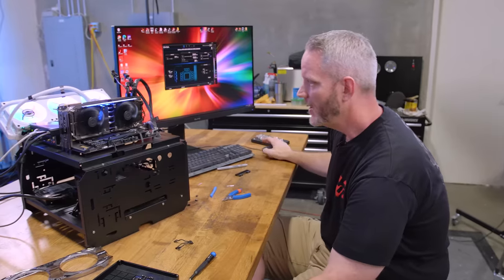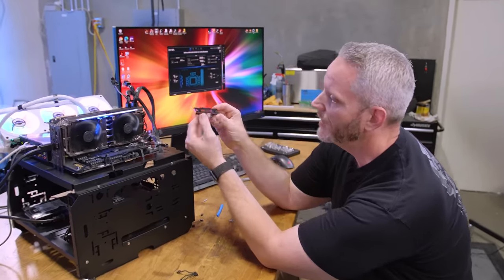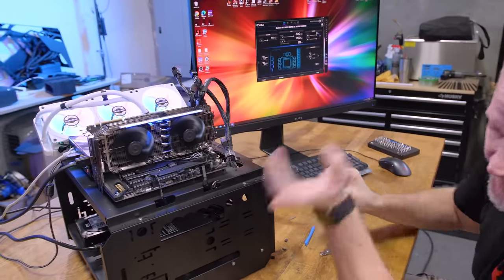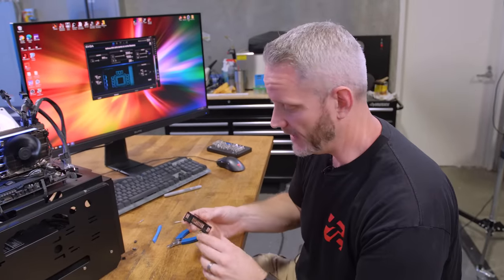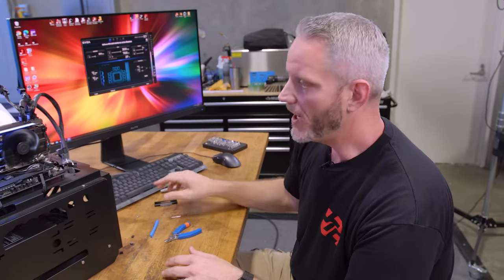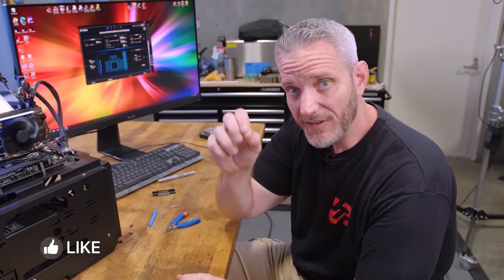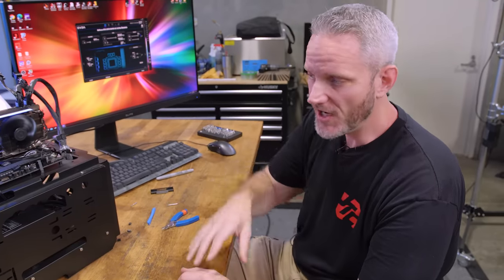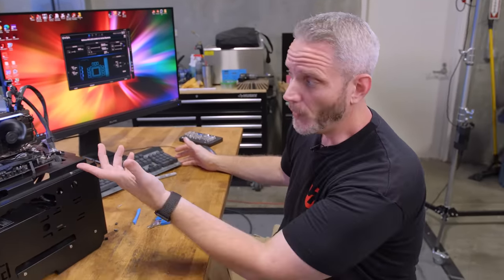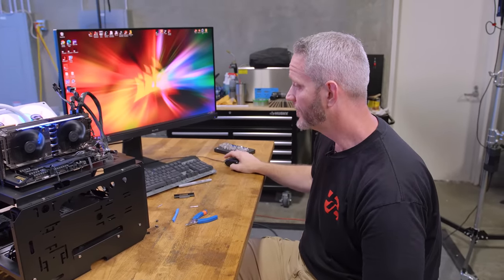Now we can give his card back all up and running with a replacement harness. To do this yourself, pop off the end piece — just tabs on the bottom and top — which gives you access to the harness. If you have a fan going 100%, you can also try wiggling the cable while it's running and see if the RPM changes; if it does, you know you have a bad wire too. EVGA may have spare harnesses from RMA parts. Anyway, thanks for watching — see you in the next one.